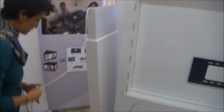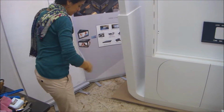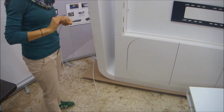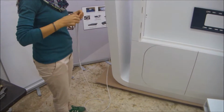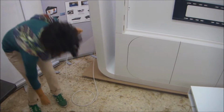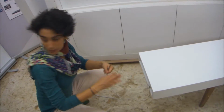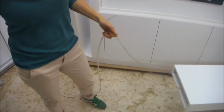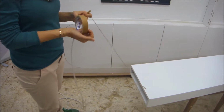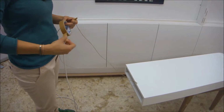What you need to do first is bring out all the length of the cable that we passed the first time, and you take this side and remove the first rope that was installed. So this rope can be discarded, and there is another one installed in this one. You bring the piece of rope, and you bring back the paper tape, and we advise you to stick it this way and then stick it well to bring the cable out from the other side.